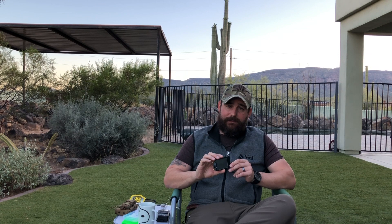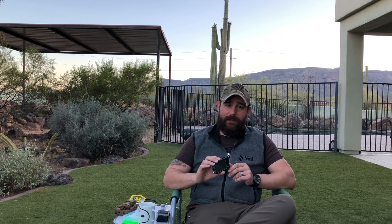While I love the RigXpert Zoom - the quality, the durability - for me the size is just a little bit too big for traveling, and I really can't use it for VHF or UHF. The Nano VNA, on the other hand, is $50. It's not as durable, but I can afford to replace it a few times if it breaks in the field. What I like about it is that my antenna system allows me, with one feed line, to work VHF, UHF, and one portion of the HF frequencies. And this was the first time I was actually able to test the SWR on my ATOS 25 for 2-meter and 70-centimeter.